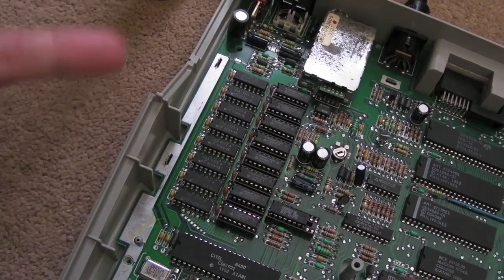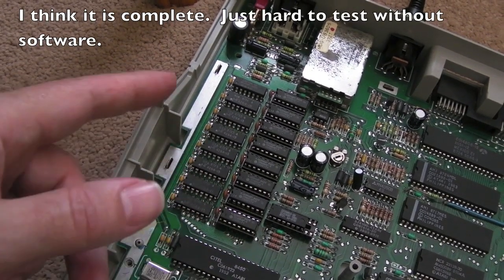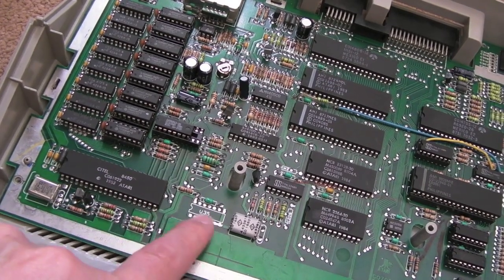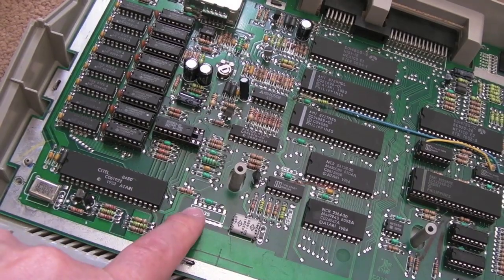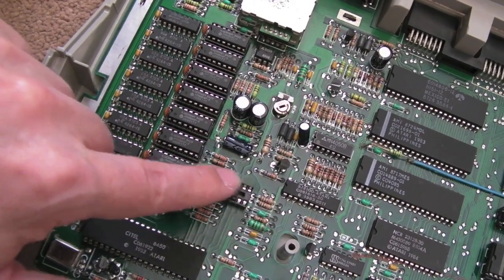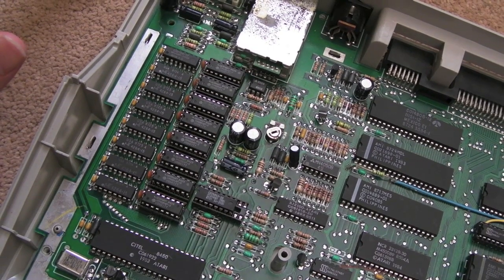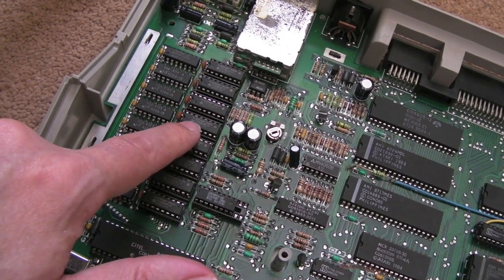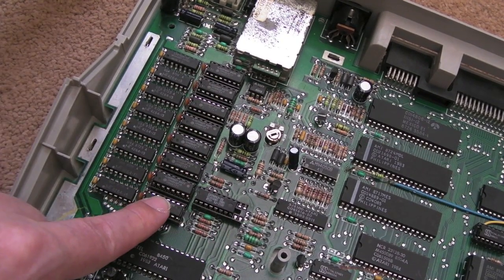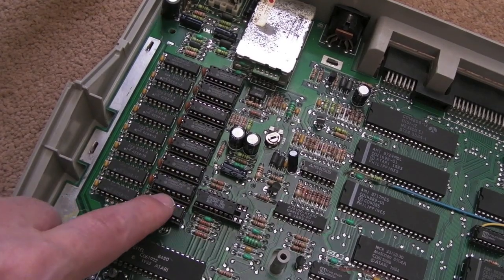So there are eight chips in here now. When I let that test go through, I just got three rows of RAM — all green. I'm not sure whether this is complete; we might need a jumper or a wire or something. It could even be this chip down here. When we looked at the photo of a 130XE board, it didn't have anything there, so I'm not sure that's absolutely required. In closer inspection, these chips are manufactured in West Germany — shows you how old these are. They were pre-Berlin Wall coming down. I'll put the part number up here because they're a good alternative for 4164 — they work quite well.